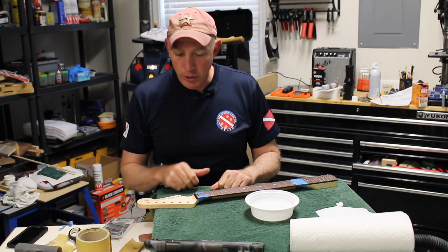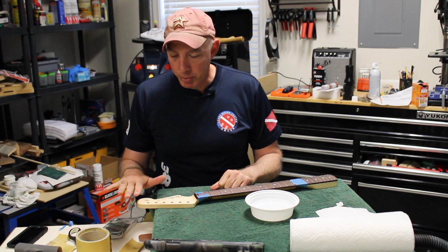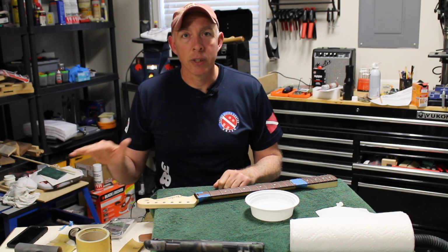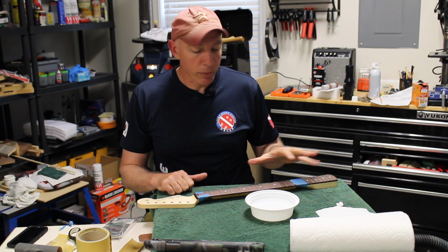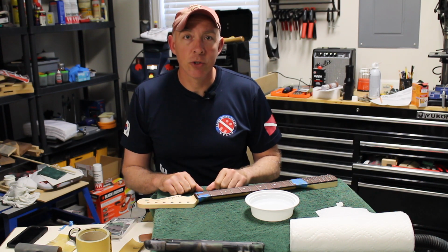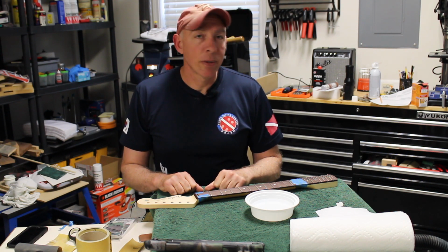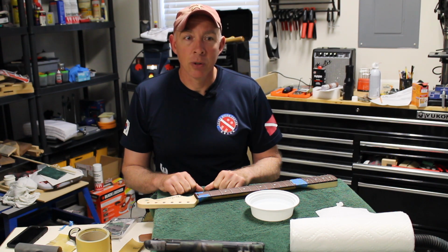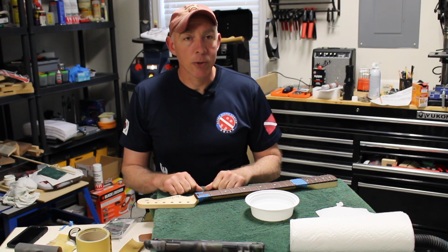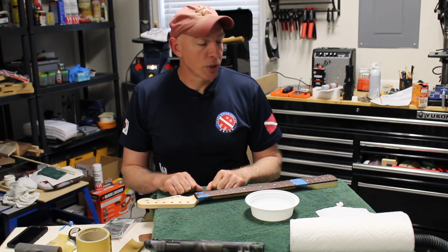the fretboard. I'll spray a quick clear coat of lacquer over the top of the headstock, and then once that sits for a little bit, I'll start putting the aged clear over the top of that and on the rest of the neck, and we'll be going. The next thing after that though is to spray some additional coats on the body. Although it's rainy and wet outside right now, so the weather's not really with me, so I might have to put that off until a little bit later. But once I've done that, I can start spraying up the body, and this thing will be just about ready to start assembly, which I'm looking forward to.